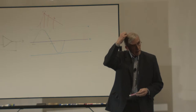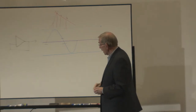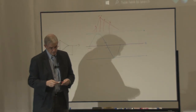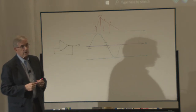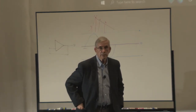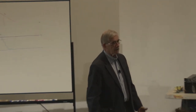And they denied it, of course, that it would even do that. So I don't know that you're going to damage the amplifier. What's going to happen is, if you come down here to the 2-ohm part, look how much power you've lost. They just won't put the power out into lower impedances. But I wouldn't worry too much about damaging. Is that loss of power coming from the amplifier power supply? Yeah, the power supply just can't deal with it. Even if it did, you've got these transistors in the middle of it. They can't deal with that type of current.